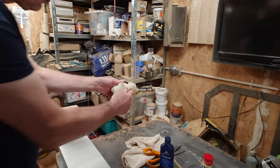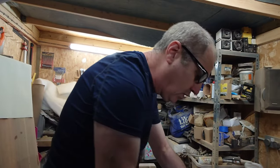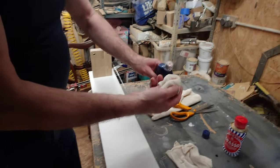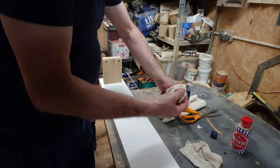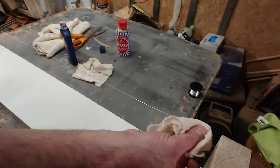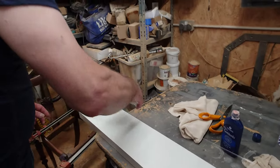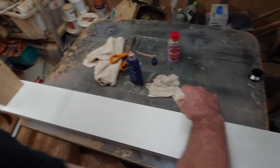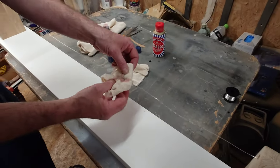Over a period of time silver will oxidize, as will any precious metal. We're going to put a bit of silver polish on there — give it a shake first. The beauty of this jig is that before I was having to hold the wire and do it, but now I can just put it on there and go up and down until it gets a really nice sheen. You can keep going up and down for quite a while to work it — you really want to get a really nice sheen on it. You're basically polishing the surface of the conductor.